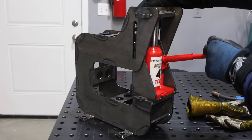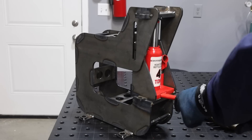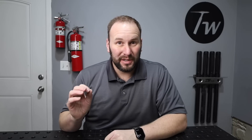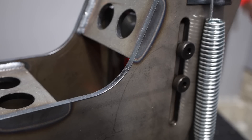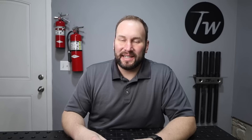It works really well overall. There are a couple of things I'd probably do differently: I might go a material thickness thicker on it so I don't get quite as much deflection as I load it up with the jack. Another thing I'd do is look at a different way to guide the carriage up and down — my arrangement with the shoulder screws works pretty well but it could be better with some kind of linear guide, bearing, or bushing on a rail. But overall it's good enough to suit my purpose, so I'm happy with it. Thanks a ton for tuning in today. If you enjoyed this video or learned something, let me know by hitting that thumbs up, and we'll see you next time.